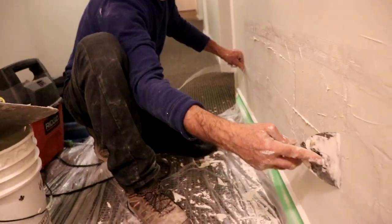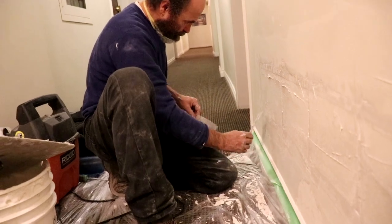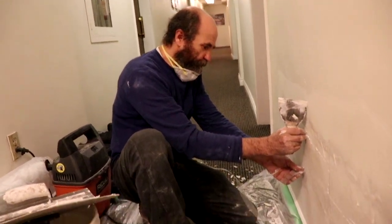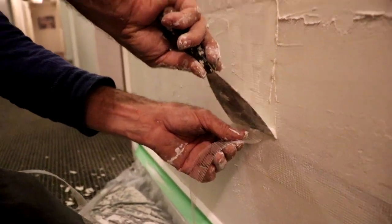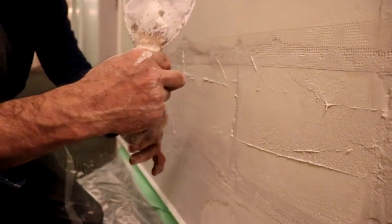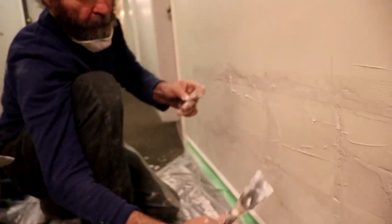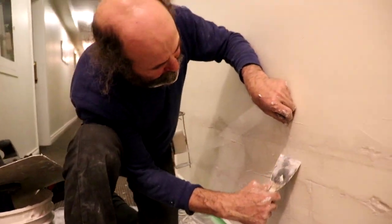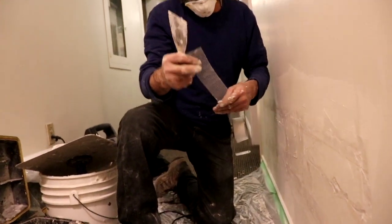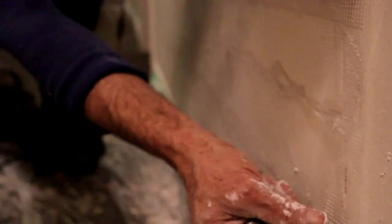You just pull it, clean it, right on top of the wet concrete fill. And then all this small gap, we just put a little tape. Like in our previous video, we said that we don't like to overlap because it builds up a little bit higher, so we just put the mesh tape in there, and then we go to the next one. It doesn't matter which way you go, from bottom up or from top down, in the end it works exactly the same, like you guys can see.